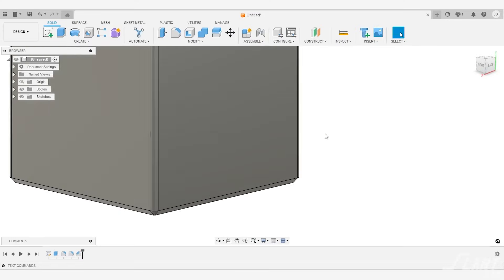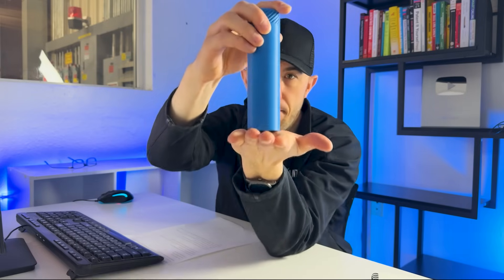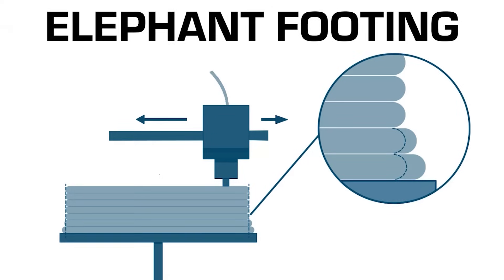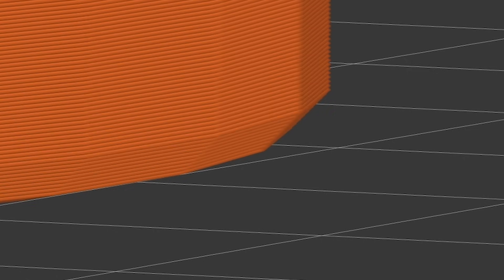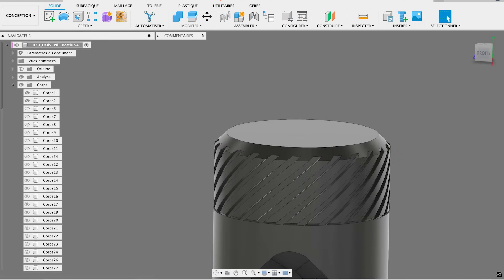You also want to chamfer the first layer edge — a very small chamfer along the outer side, generally about one millimeter. That chamfer makes sure you don't have to worry about side extrusion or different flow rates; it all disappears with a simple chamfer along the bottom. That's how you clean up all your edges so you get a part that looks really crisp and beautiful. And if you have a chamfer on the bottom, you can apply one to the top to create symmetry. This part can be printed with any resolution, any material on any machine, and it will still function as intended.